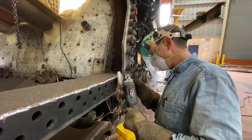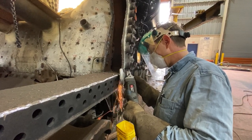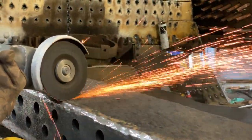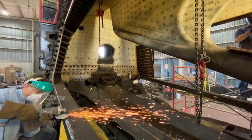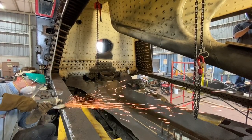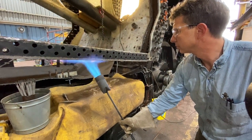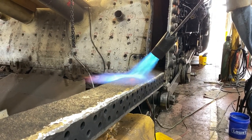The process of building up the mud ring — it had kind of rounded over from corrosion because the outer wrapper side sheet was not a tight fit when the locomotive was originally built. So the first step is to grind down the corrosion until it's clean metal, then heat it up to about 200 degrees before you start welding on it, and then lay an adequate amount of weld down that will allow you to go in and grind it flat and smooth, restoring that edge.